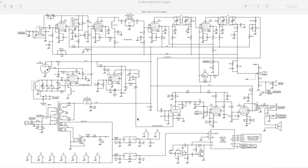Those are the main changes I made. I didn't use the Arduino-based frequency counter — I used one of those Chinese units that you can enter the IF as an offset, which works quite well. It's programmable and only cost about £4 from AliExpress — very cheap and they work well. Saves you messing around with Arduinos. The other change I made was I didn't use solid-state diodes; I used a GZ34 rectifying tube. If you want more information, check out Mike's website — just put in Octalmania and you'll find all his projects. Anyway, let's show you the rig itself, the top and the bottom, and then we'll give you some demos of it in action.